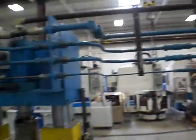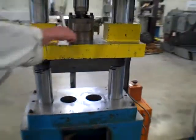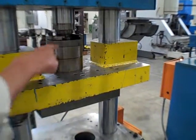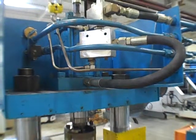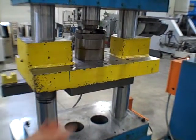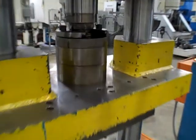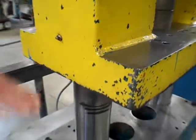It's the press itself. It's got a regen circuit. It's a Neff. All the Neffs have that, I believe. We're stacked up about 8 inches right here for what it's worth, so you can put this in different areas because as you see the stroke isn't that great on this, so you can space this up or down depending on what size part you want. Right now, whoever ran it had 2-3 spacers in there. That whole thing just slides right out right there if you get a close-up of that. That's somewhat meaningful, so we're running about mid-range right now on the post, which is fine.